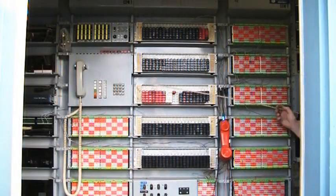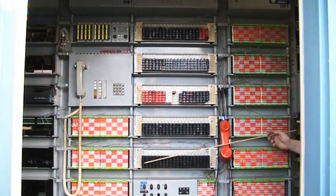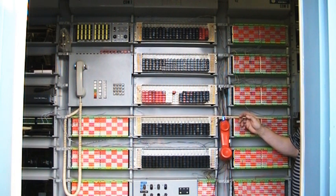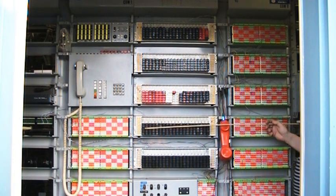This is the Western Electric CDM that was built with the number 3 crossbar. It's a miniature cosmic frame, a similar design to a regular cosmic frame, except the blocks in a normal cosmic frame would be yellow or blue. These are heat coils for each of the subscriber lines, so there are 100 potential phone lines here going off to the businesses or residential people in the community.